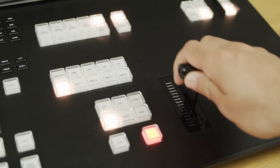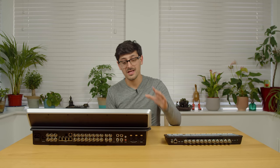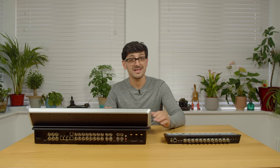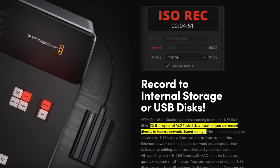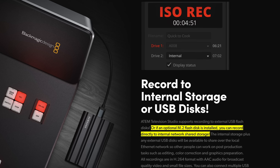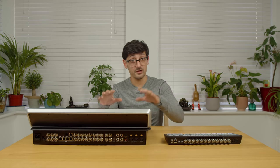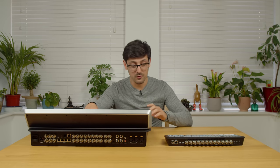There's even a physical t-bar as well. One key physical difference you can't see from the outside is storage. Both units have two USB-C ports on the back for connecting external SSDs, but the ATEM TVS also has the ability for internal storage. It features an M.2 slot allowing you to install flash media directly into the device and record straight to it. I think this feature alone would probably convince me to buy this model over the other, and I want to share why.